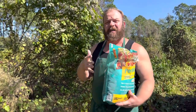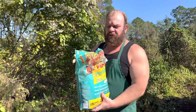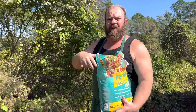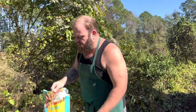I'm not going to show you the actual mix because there are several versions of it, but I'll tell you the mix I've worked with that I've had good results with. I use perlite — vermiculite is a smaller, grainier type stuff, while perlite is lighter. Because it's a lighter color, it's easy to tell that you've got a good amount of cement in there, since you don't want any color from your aggregate showing through. The mix I use is one part Portland cement, one part sand, and two parts perlite.